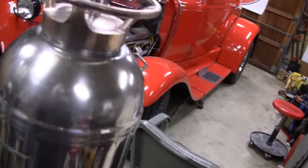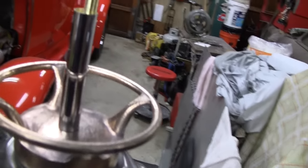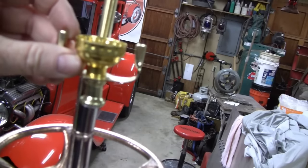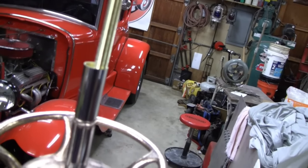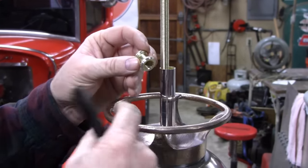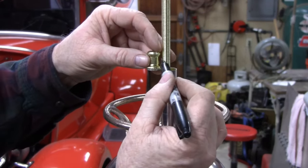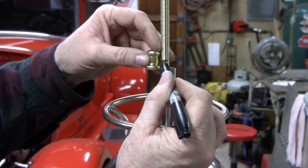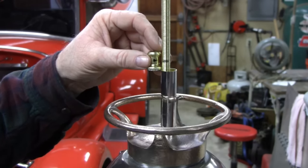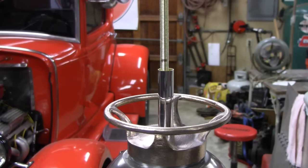Alright, we're back. I got this chrome piece — like I said, I cut it to four inches. But I think I'm going to cut it down to three inches, because this finial on the bottom is going to add another inch. So instead of raising it four inches I'll just make it three. It's time to cut this threaded rod. I even cut the bottom of the finial on the grinder so it fits into the chrome piece. I'm going to want to cut the rod right about in the middle of the finial, because you've got another threaded rod going through there. I've got extra rod on the bottom so I can come up or down if needed. This really isn't too critical but get as close as you can. Let's cut that.